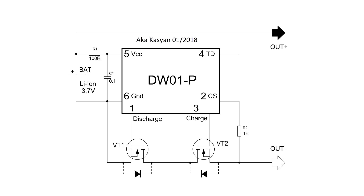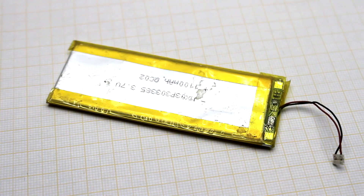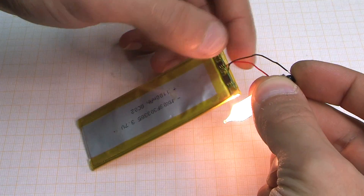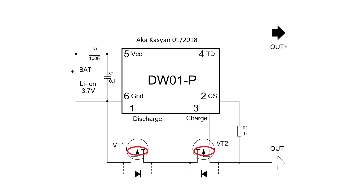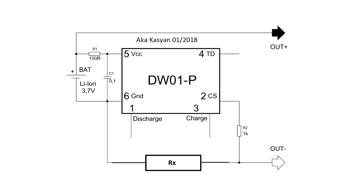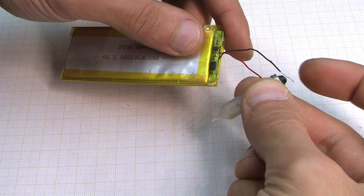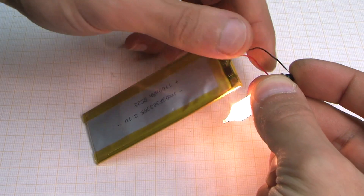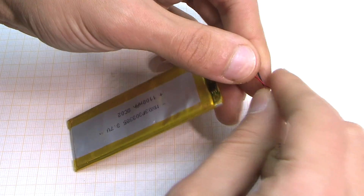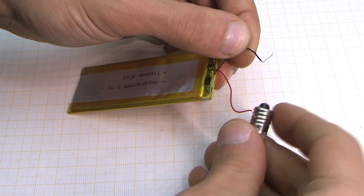How does short circuit and overload protection work? Lithium batteries, depending on their capacity, can be discharged with a certain current — for smartphone batteries this is about 1A. The chip monitors the voltage drop across the transistors. Inside the transistors there is a certain resistance, giving us something like a current shunt or sensor. The greater the current, the greater the voltage drop on the transistor transitions. If it reaches a critical value of about 150 to 200 mV, the chip closes the transistors and disconnects the battery from the load. The circuit is restored in less than a second after you remove the short circuit.